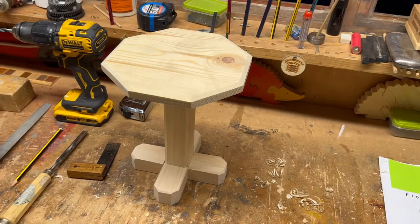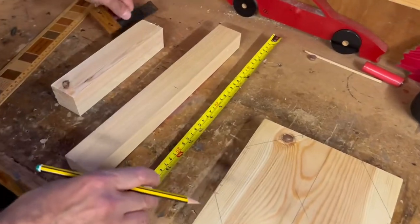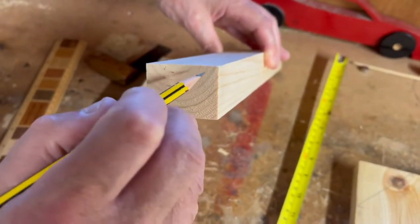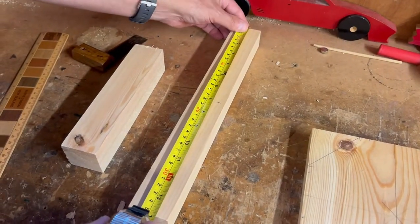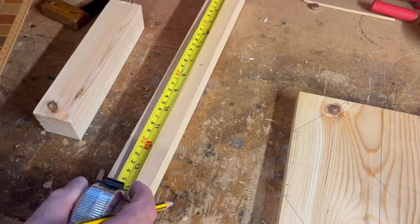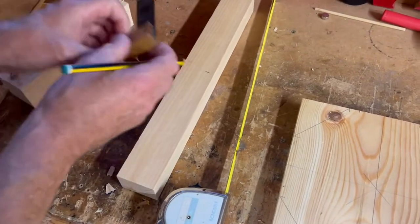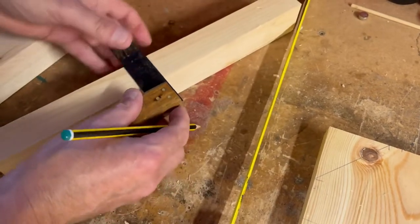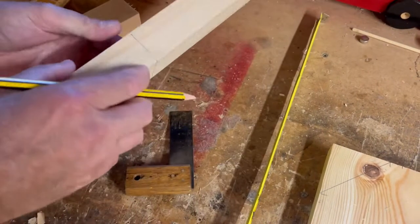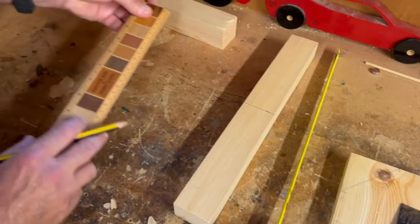It's for cups of tea, bottles of glue, or whatever you may want to use it for. We'll look forward to the clips coming up showing how to make it in easy stages. I've got this piece of timber here which is about 3cm by 2.5 or 3 — actually it must be 4 by 3 — measured at about 350mm. Yours might be about 300mm and you just divide that into two, in this case 17.5cm. Use your tri-square to make a mark all the way around, then cut that on a bench hook using a tenon saw.